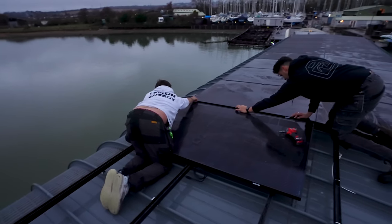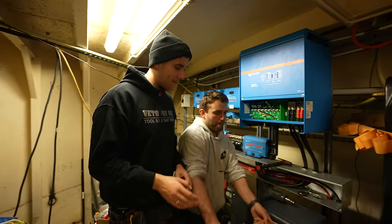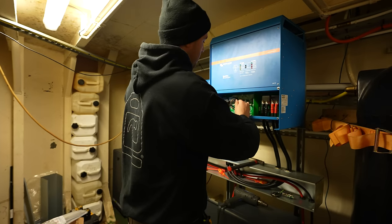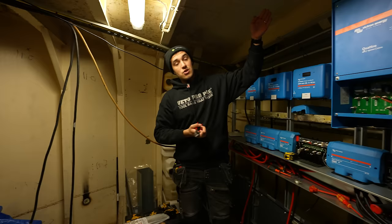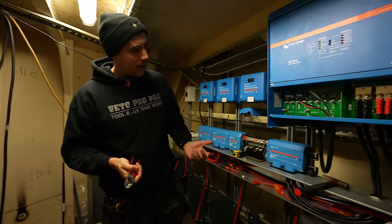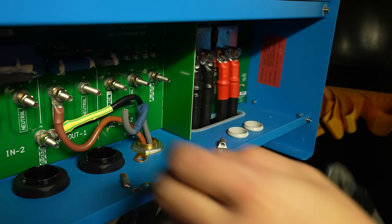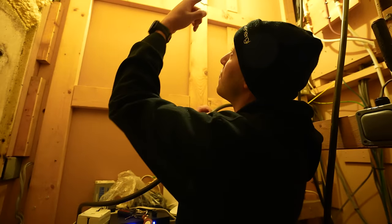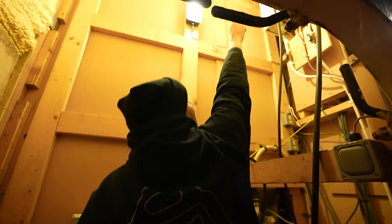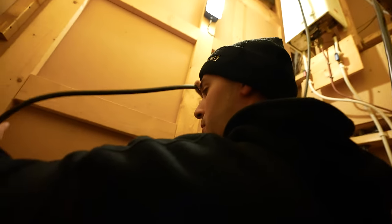We've got all the panels bar two up on the roof and we've just run out of daylight. So what we're going to have to do is cut the rails a little bit shorter and adjust a couple of bits — we're going to leave that for tomorrow. But that means we're on the dash to get them some power for tonight. At the minute, all we've got is the old 16 amp feed going directly into their distribution board, and every time they boil the kettle it's tripping even quicker now. So what we're going to do is connect up just these two batteries and have a supply out for tonight. The DC cables come off the roof, round the edge, up inside this little hockey stick and into that corner, so I'm just going to have to go Spider-Man on it.